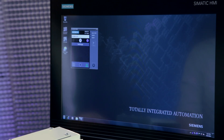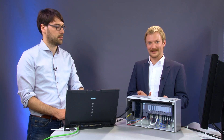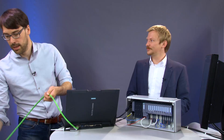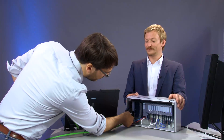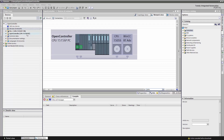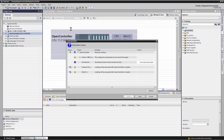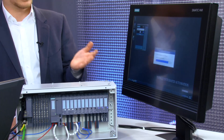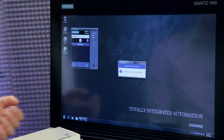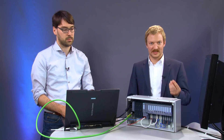My system is now fully operational and I can see the display app of the software controller. No other Windows settings are required for the functionality of the software controller. I can now go directly to the engineering framework of the TIA portal and start my project. The first step is to connect our PROFINET cable to the OpenController. We open the interface where we set up the IP address earlier and then directly select the OpenController in the TIA portal. Then we start the download to the device, just like with any normal CPU. We check everything once again and commence the loading process. I can see on my OpenController that something is downloading, followed by a message that the OpenController will now restart. This only happens once for initial commissioning — later projects will be downloaded without prompting a restart.